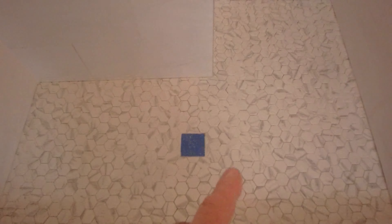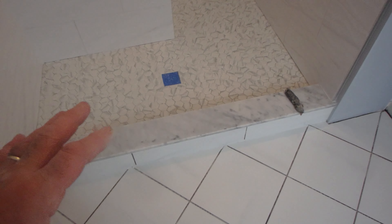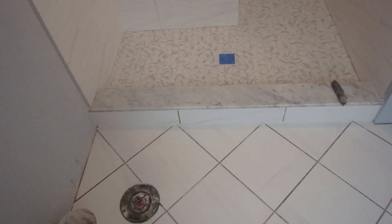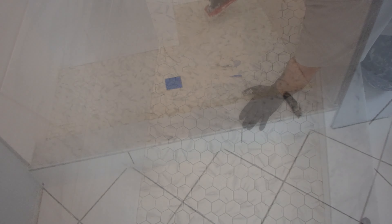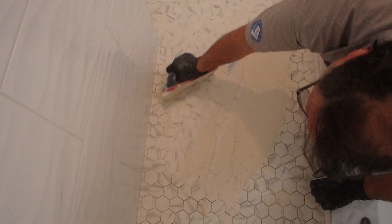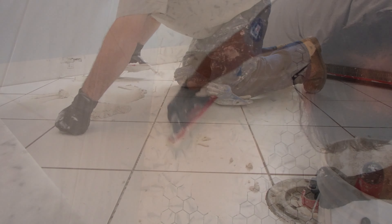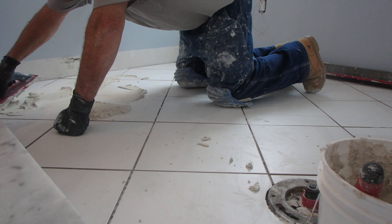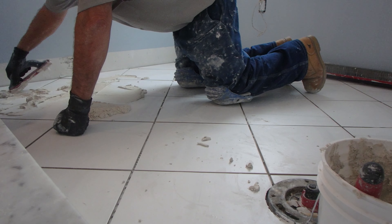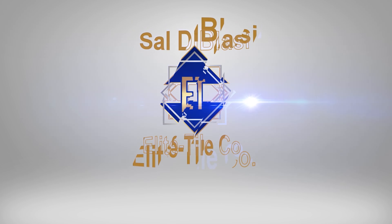This is going to go a little differently than the wall, because the wall tile was very porous so it grouts up very quickly. The floor tile is porcelain — not porous — so it's going to take a little bit longer for the grout to set up. I'm going to grout the whole thing, let it set up until there's no transfer to my fingers, then wash it down. I'll upload a second video on how to grout the floor, since it's a slightly different procedure — you have to wait for the grout to set up before washing. Next video: how to grout a floor.